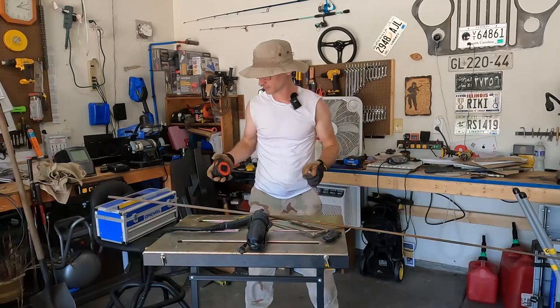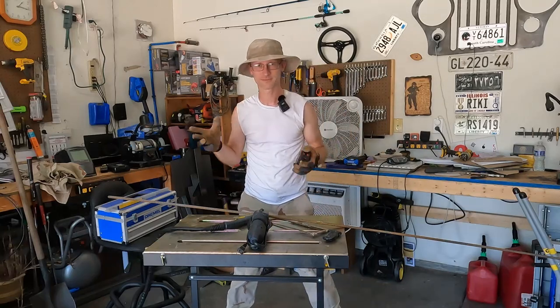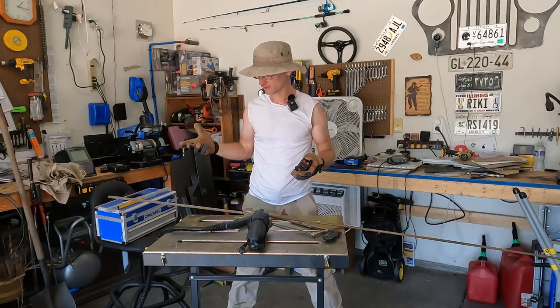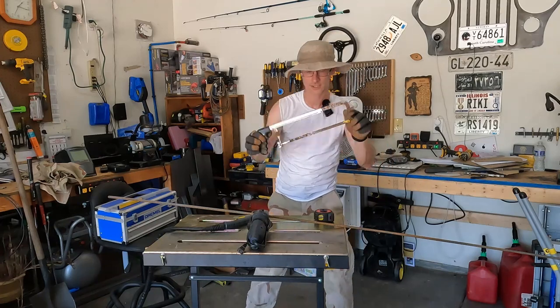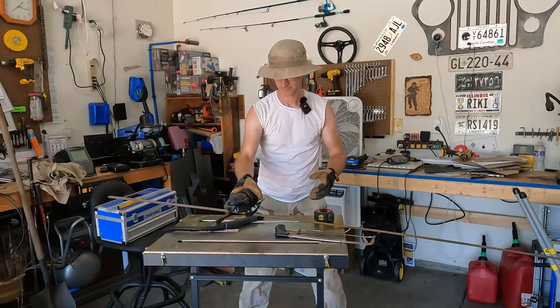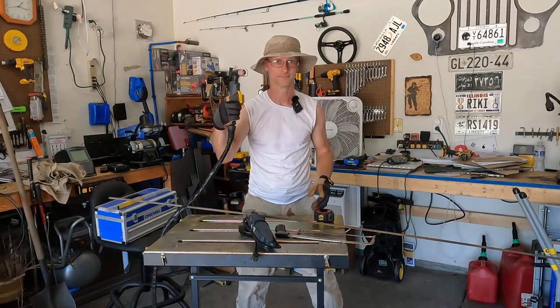All right, when it comes to cutting this rebar, the timbers, the 6x6s, are about 5 3/4 inches thick or something. So I'm just gonna cut off foot-long pieces. I'm gonna need at least two per board. There's four boards, 8 pieces, math. One way that you can cut these things is with the old rusty trusty hacksaw. You could also go a little bit grinder fancy with a cutoff wheel. In my case, I've got it, so I'm gonna use the plasma cutter.